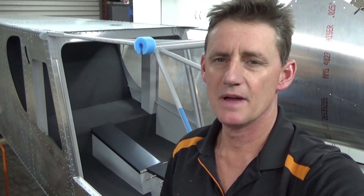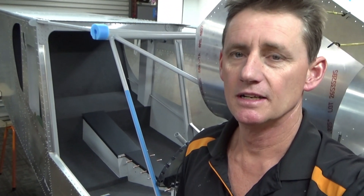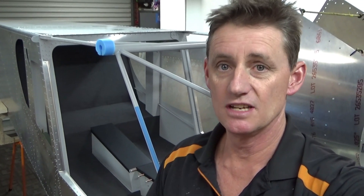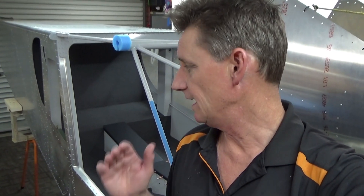Thanks for watching. I was nervous at first attempting the carpet — worried people might laugh at me. But years and years of RC model aircraft covering paid dividends. People have asked via message whether aeromodelling helps with building a full-size aircraft, and that's one instance where it definitely did — just doing all the nice edges and that sort of thing. A couple of tips: I went through about 20 exacto knife blades — basically every cut was a new blade. You can feel it start to tear the fabric. The fabric I used was limp — it drapes like a tea towel over your hand — and that helped as well.